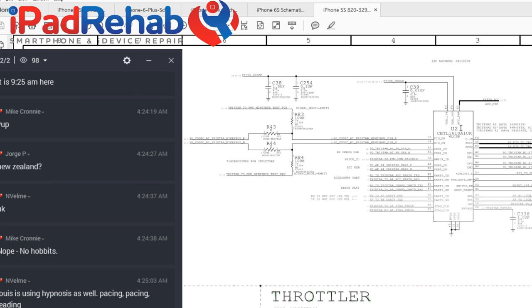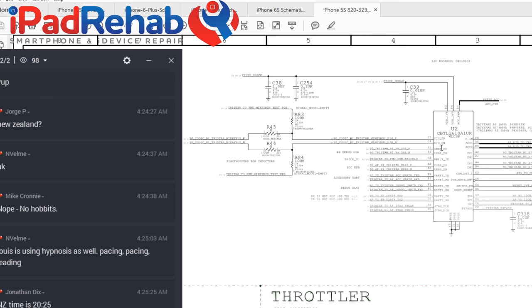But at this point, this phone pulls zero charging current no matter what you do. And it could be something as simple as, oh yeah, the dock went bad after multiple connect-disconnect cycles. We don't know. Or it could be something to do with the pads, although I doubt it, from just installing three or four chips on them. That doesn't make very much sense to me. We did jump the Q2 that separates USB 5v0 from USB 5v0 protection. That didn't do anything, so that did not bring back charging.